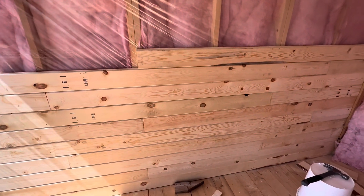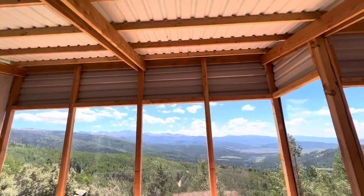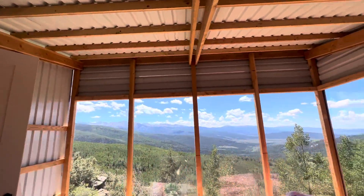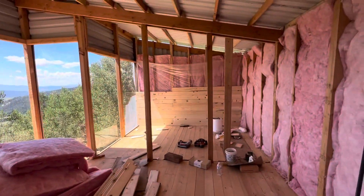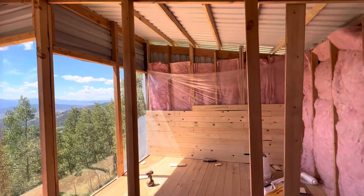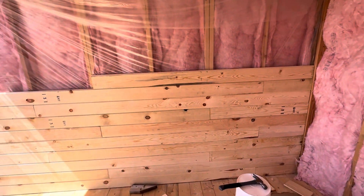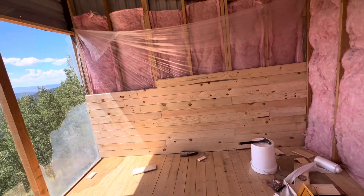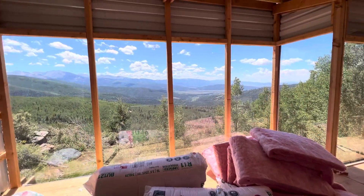You've got yourself a good looking wall, especially if you can stain it with polyurethane. We're going to use this on the walls and the roof — it's a pole building so there's going to be some shifting, so you don't want to use sheetrock. And I wouldn't want to haul sheetrock up the hill anyway. So this is how to install one by six tongue and groove for your interior walls. It'll take us a few days, but once we finish it we've got a nice space to hang out for a week or so during the summer.